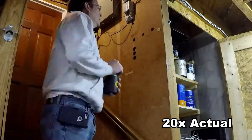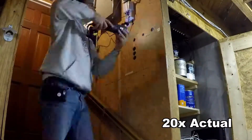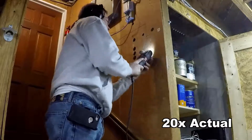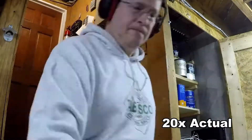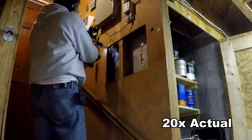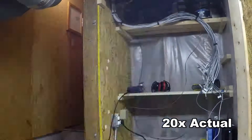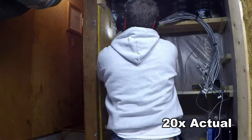I'm going to cut this hole. Normally I'd use a drill and a jigsaw, but what I used here is a Bosch oscillating tool. This is great for this because I didn't know what could possibly be in the wall — I didn't think there were any cables, but you never know. Using a fine blade, it burns a little and you can see some smoke and dust, but it does a great job. Right in the middle there's a stud, but since this is not a load bearing wall the stud doesn't have much purpose, so I'll just cut it out. I mark it on the inside and use a slightly rougher blade on the oscillating tool to cut everything out.